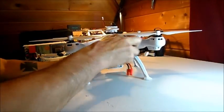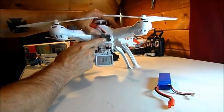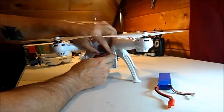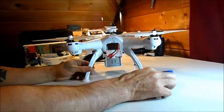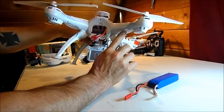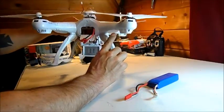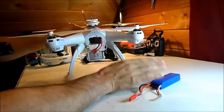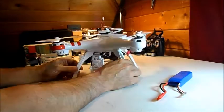The battery fits in and out of this thing really nicely with lots of room. I made a little hole in the door and I run a low voltage indicator so you can always know what your battery is doing. You can set it with this little button — I set it to 3.6 volts, and this thing is really loud, so it'll start beeping when the battery gets low. This quadcopter has really good flying times on its battery. The reason I did this mod is because the lights are supposed to flash when the battery is low to tell you to land, but the lights also flash when you're doing video or pictures, so it gets confusing. Plus in daylight when it's sunny you're never going to see those lights, but you'll hear this thing beeping. It's a really super cheap mod that will save you from crashing a lot.